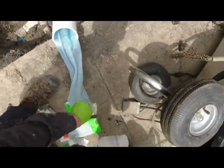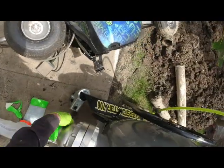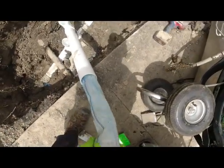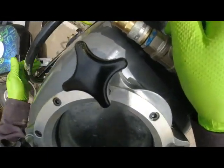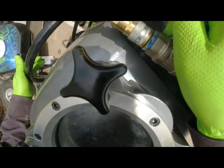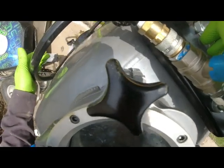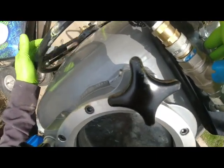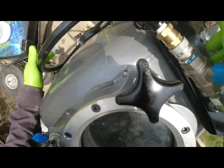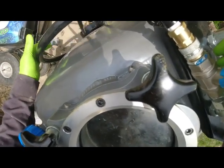Here I am inserting the calibration tube, which will not only set the liner to the inside of the old pipe, but will allow me to pump hot water into it and cure the whole liner. As it's inflating and inverting, the cal tube is pulling along with it a lay-flat hose — about one inch in diameter, flat so it can make around bends. When air or water pressure inflates it, it opens up and allows water to travel to the far end of the liner, circulate back through the water heater, heat up to 160–180 degrees, and cure it. The exciting parts are over.